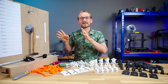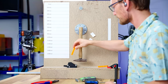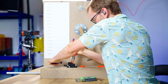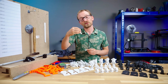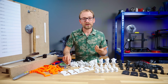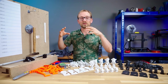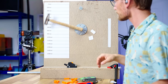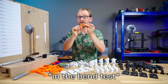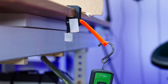What I immediately noticed is that the lower temperature parts, PLA and PETG, pretty often got stuck in the jigs. These have a bit of tolerance between the sample and the holder, but the parts printed below nominal temperatures were even too big for that. Interestingly, all the PETG parts that were printed flat broke in a way that's actually really good for functional parts. Instead of snapping in half like the PLA did, they stretched, pulled, and kinked — meaning they failed gradually. Typically, if you have even just slightly moist PETG filament, it's going to snap off much more sharply because of the hydrolysis mentioned earlier.